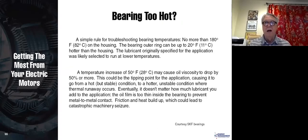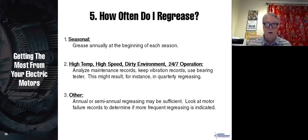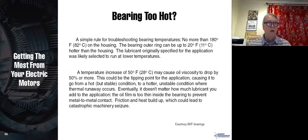You need to leave your drain plug out and run that motor for about 30 minutes to allow it to pump that excess grease out, otherwise your bearing will run hot. The number one reason for motor failure is bad bearings, and the number one reason for bearing failure is improper lubrication — could be too much grease, too little grease, the wrong kind of grease, but mostly it's just greasing in the wrong way. This is where we ended: how often do I regrease? Not only do you need to worry about the motor being too hot, but the bearings as well.